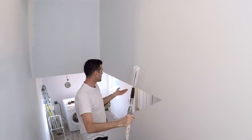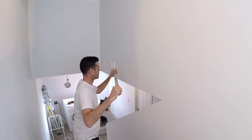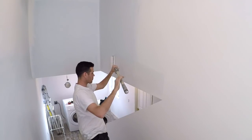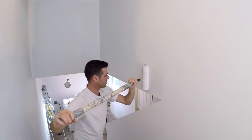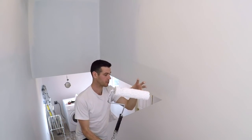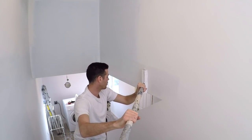So for starters, let's unload the roller a little bit. I know I'm going to be painting here, so I've stayed about two inches away from the edge, just unloading this roller. And now at this point it's to the point where it's not dripping, it's not fully saturated. Now I can start going down to the corner.